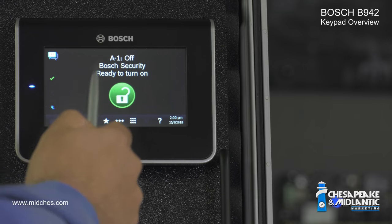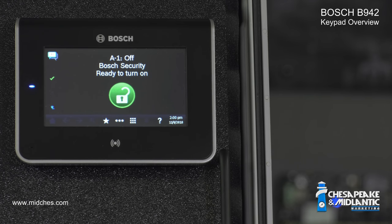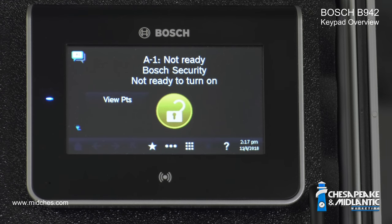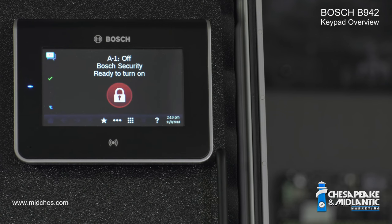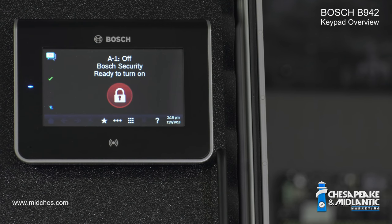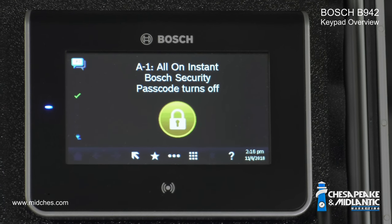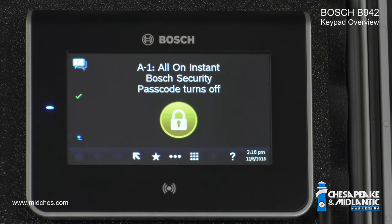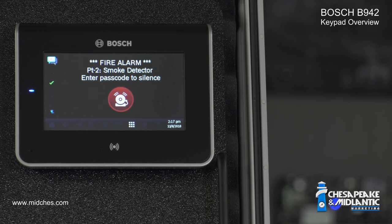The main screen shows you the state of the alarm. A green circle with an open padlock means the alarm is ready to arm. A yellow circle with an open padlock means that there is an alarm sensor that is open and the alarm is not ready to arm. A red circle with a closed padlock means the alarm is fully armed. A yellow circle with a closed padlock means the alarm is part on — a feature that allows you to only arm certain devices on the system, for example arming all the doors and windows while leaving the motion detectors disarmed. A red circle with a siren icon means that the system is in alarm.